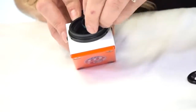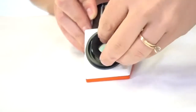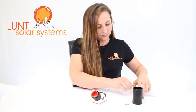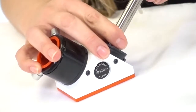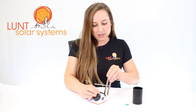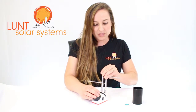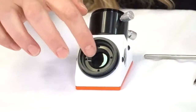There's a little shelf here — you can just put the new BG in place and you'll know it's sitting in there. Put your retaining ring back in and tighten it back down all the way. Once you get it tightened all the way, we recommend actually backing off about a half turn, even a quarter turn really. The idea is to give the filter enough room for expansion, because it does heat up quite a bit. If it's tightened down too much, it's actually going to crack under the pressure, so you do need to allow it a little bit of space.